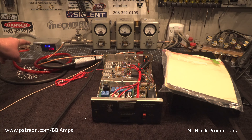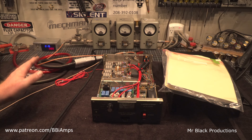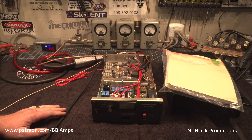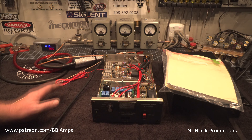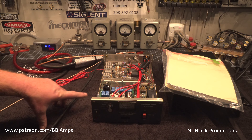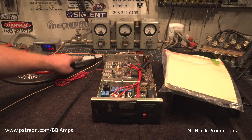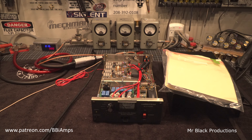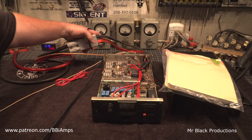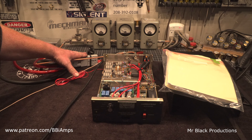This is an average reading meter, right? We hook up a peak meter and we're going to see much more, but on average you want about 100 amps with the supply. On your average vehicle, that's 10 or 15 feet of wire going from the battery up front back to where you're going to have this thing mounted. That's why I say run a piece of four gauge, get yourself an Anderson clip — four gauge — because DC does not like to go very far without losing a bunch of current. That's why I do the dual eights on the positive and the negative, and we hook it up to a 150 amp Anderson clip.